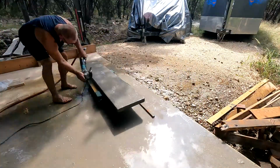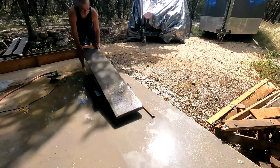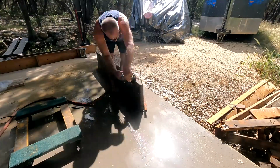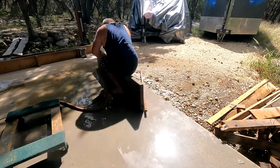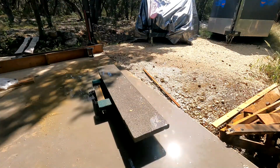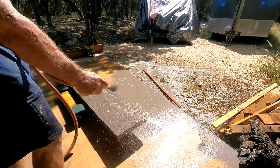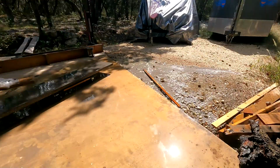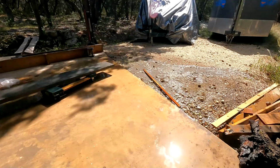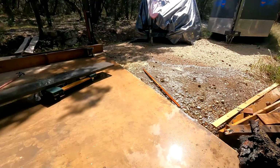We're just doing a kind of a matte, quick grind on it, taking it down, I'll say about 1/8 of an inch, maybe more, to expose the aggregate and a few rocks that we placed in the form. So doing the edges and all that stuff came out real nice. I did add a little bit of black color to it. Can't really tell, but there's the finished product when it's wet. When it dries, it gets a little bit, of course, chalkier, more concretey, and we'll seal it and put it in place. But anyway, that was the end result. I think it turned out great.